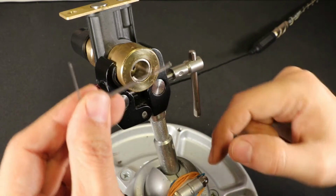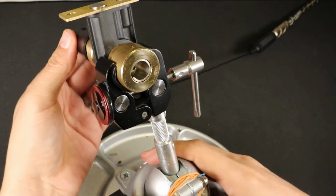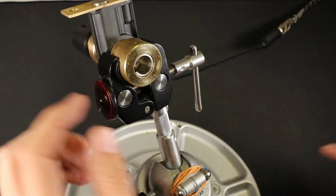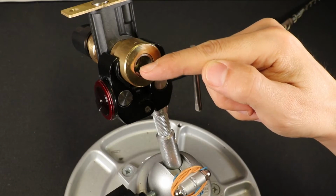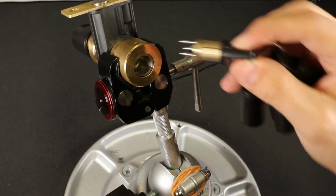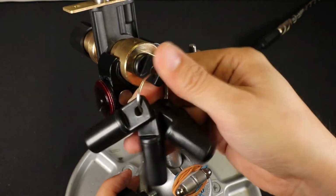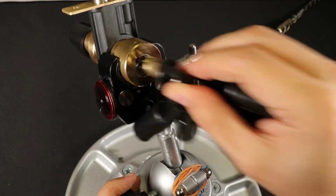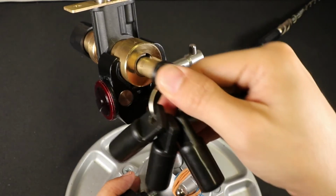What I did is I took a wiper insert and I cut a slot in it. So on the hot dog lock, it has 6 pins inside, and like a normal tubular lock, once you pick all 6 of those, it'll turn to the next position, so that the leftmost hole will go to the next position, and then it'll lock up again. What's interesting is that most of these tubular locks hold on to the key, and you can only pull it out when it's locked or unlocked. But this one, every 60 degrees, when the holes line up, you can pull the key out, which is cool.